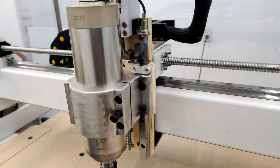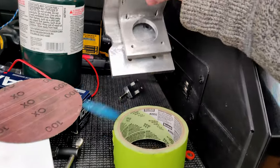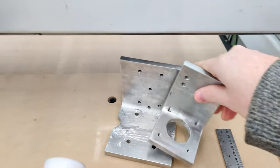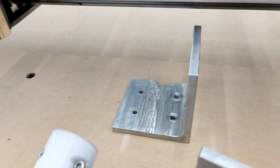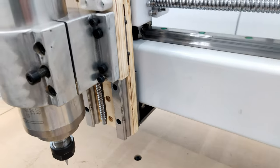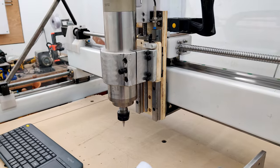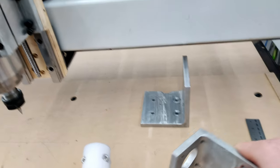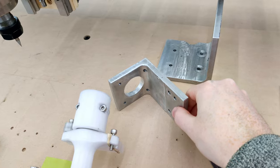For the CNC machine, I've replaced the bottom aluminum piece with a steel piece that is a lot more accurate. These are the old ones — it's off by a degree, coming out this way, so that's no good. When I was running it I had to shim everything and it was adding some binding. That's fixed now. This piece here that went up here was really a bad design flaw.